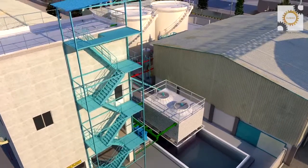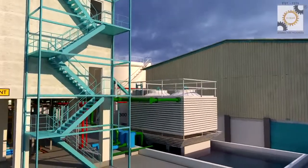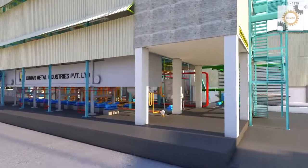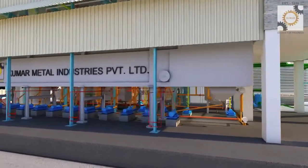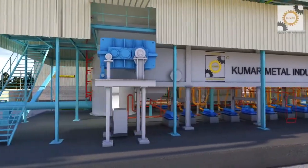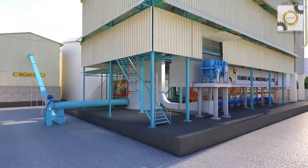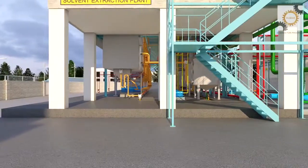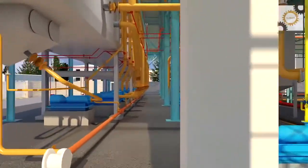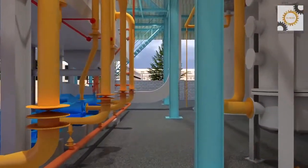The solvent extraction process involves extracting maximum oil from prepared raw material. This is accomplished by spraying hexane in different concentrations on the moving extractor bed in a counter-current manner. The desolventiser toaster ensures removal of hexane and minimises urease activity in the de-oiled cake with the help of controlled toasting.